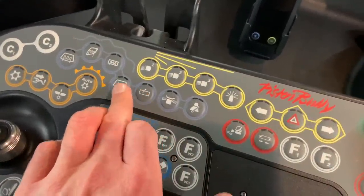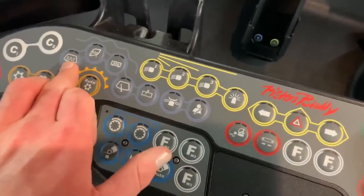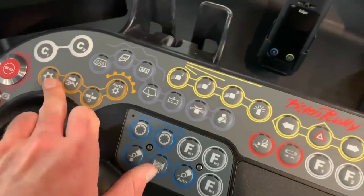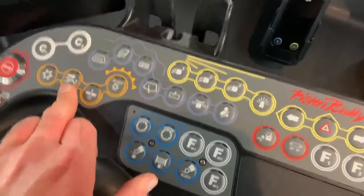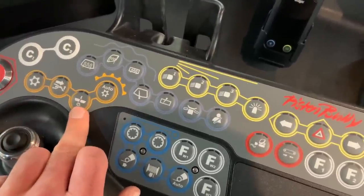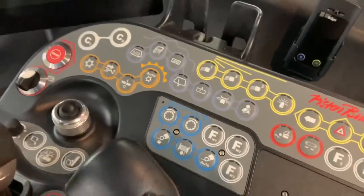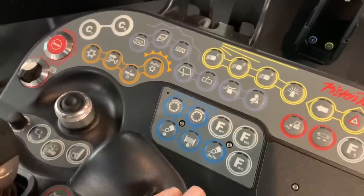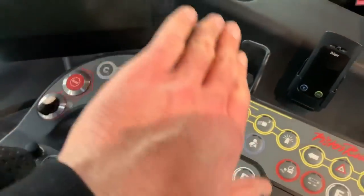There's your rear wiper, front wiper, rear window heater, side window heaters, and front windscreen heater. These are your tiller controls — just turn the tiller on and off. There's automatic lift when you're in reverse, so if you hook reverse it'll lift by itself so you don't back over your own tiller, which does happen believe it or not — really good function to have. There's your tiller lock. When the tiller is free it flexes, so if you've got soft snow or you're doing a landing on a park feature you can lock it so you don't end up with a curved edge.